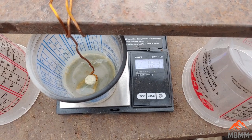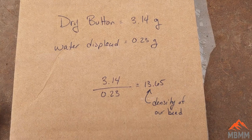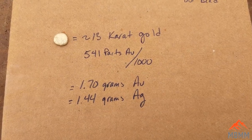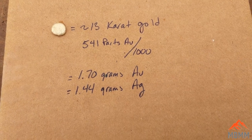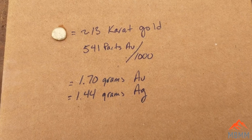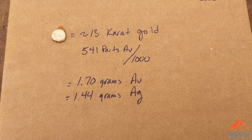So now let's do a calculation and figure out the density of that button. So here's our little calculation. Our dry gold button weighed 3.14 grams. The amount of water we displaced was 0.23 grams, and so when you divide those two, we ended up with 13.65, which is the density of that bead. There's a bunch of charts online where you can look up the density of the bead, if it's just gold and silver, and it'll give you the karat gold. I did that online, and I'll post a link to the website in the description. It came out to be about 13 karat gold, which is roughly 540 parts gold per thousand. When you do the math on that, we ended up getting 1.7 grams of gold and 1.44 grams of silver.